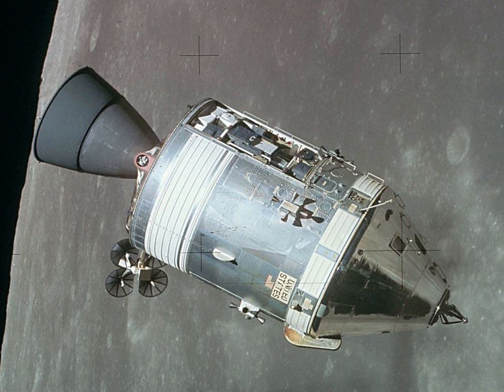The two blocks were essentially similar in overall dimensions, but several design improvements resulted in weight reduction in Block II. Also, the Block I service module propellant tanks were slightly larger than in Block II. The Apollo 1 spacecraft weighed approximately 45,000 pounds, while the Block II Apollo 7 weighed 36,400 pounds. These two Earth orbital craft were lighter than the craft which later went to the Moon, as they carried propellant in only one set of tanks, and did not carry the high-gain S-band antenna.